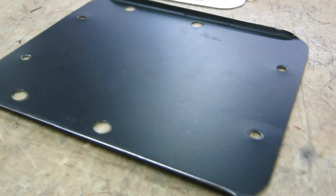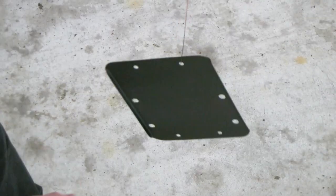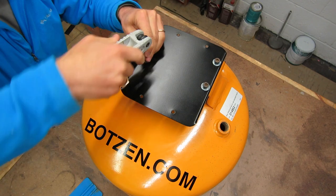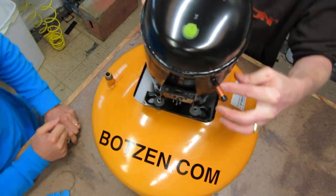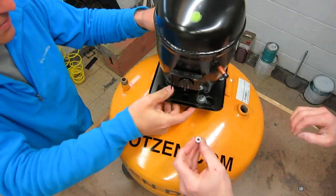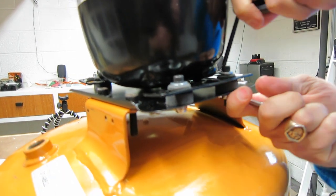The sheet metal already has a sort of black matte finish on it but I'm going to reprime the whole thing because there's a fair amount of exposed metal, and finish it with a semi-gloss black so it matches the compressor. Make sure you're always wearing the proper safety equipment like a spray mask. Here you can see my brother finishing attaching that bracket onto the air tank, and now we're going to attach the compressor itself. We're using a quarter-inch lock nut, a socket cap screw, and a washer — socket cap screws and lock nuts prevent the whole thing from coming apart, which is important given the vibration from the compressor.